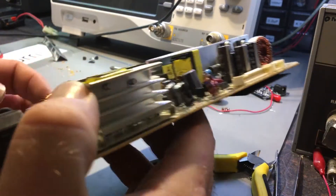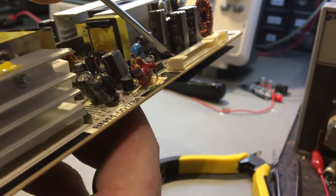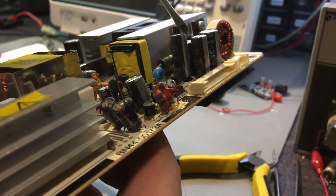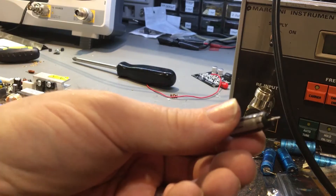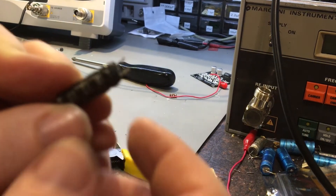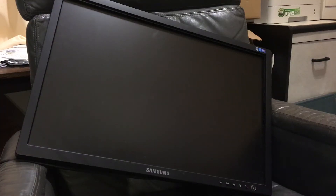Having a really close look at this capacitor, I just noticed the bottom of it — you can see it there. The sheathing isn't over it, which means it has actually blown; it's been pushed upwards. The venting on the top hasn't gone, so it looks like it needs recapping too — and that's probably what caused the failure in the first place. There are the capacitors pulled out; you can see the bottom is extended out. That's not meant to be like that.